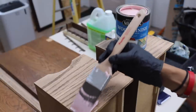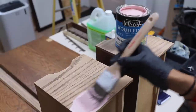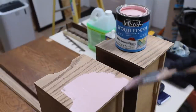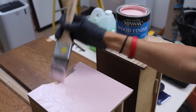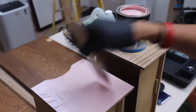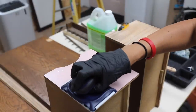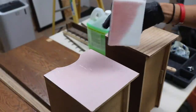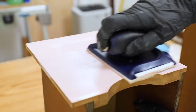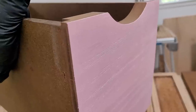And if you haven't figured it out by now, I chose pink. I love pink furniture — I just feel it looks amazing in my shed. Some people are going to love it, and some people are going to look at this and say, 'Why did she choose pink?' But that's what I love about the solid color stain finishes — you can actually choose over 200 colors to mix with this. You'll see here that after applying it with the paintbrush, I'm going to smooth it out with the applicator. This is important because not only does it remove the excess, but it gives you a nice smooth finish. And you're still able to see the grain. That classic oak grain is still visible. There's no brush strokes and it looks really, really good on the wood. I've got some color to the wood, but it still looks like wood — it's not completely covered up.